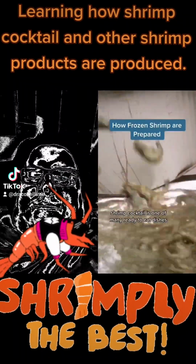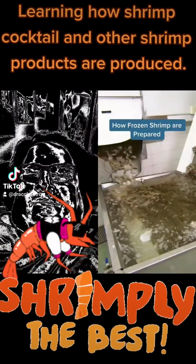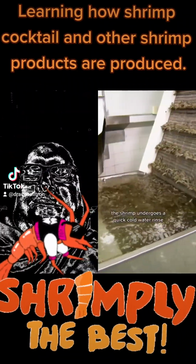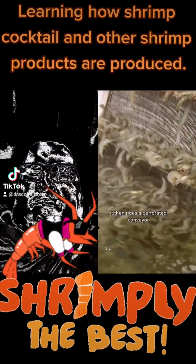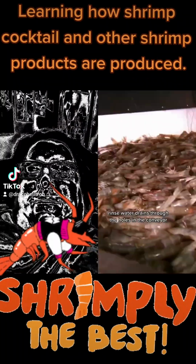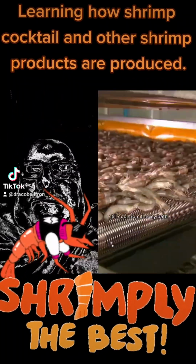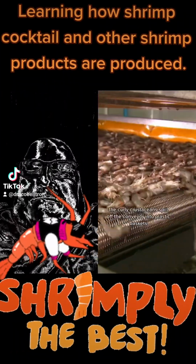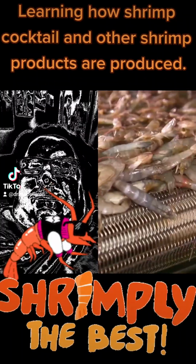Shrimp cocktail is one of many ready-to-eat dishes prepared at this factory in Thailand. Fresh from the farm, the shrimp undergoes a quick cold water rinse. It then rides a perforated conveyor. Rinse water drains through the holes in the conveyor to keep the shrimp from becoming soggy. Still cool from the icy bath, the curly crustaceans spill off the conveyor into plastic baskets.